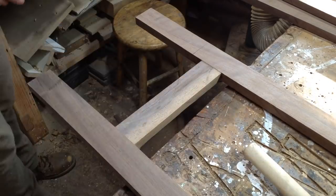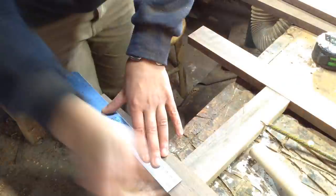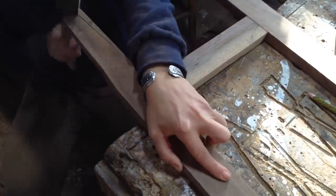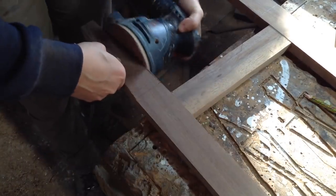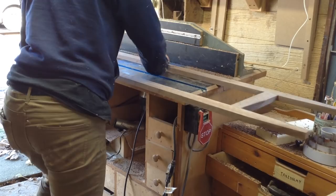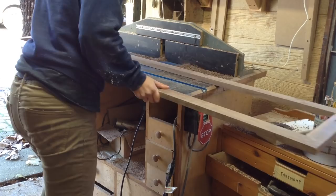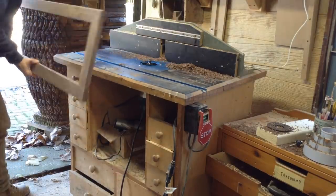Like most mid-century modern furniture, the bottoms are tapered. I usually come in about three-quarters of an inch on the bottom. I should have cut the tapers before gluing the frames together — it would have been much easier — but with them glued it would have been hard to prop them up, so I decided to hand-saw the tapers and clean them up with the orbital sander. They actually turned out pretty good for hand sawing. The edges of these pieces are rounded over, so I put a round-over bit in the router table and rounded over all the sides. The inside frame is not rounded over — just the outer edges.